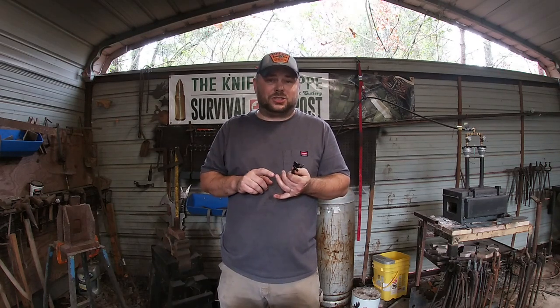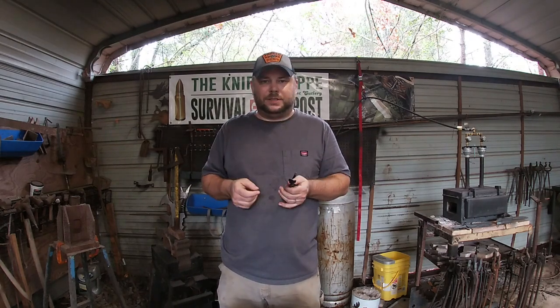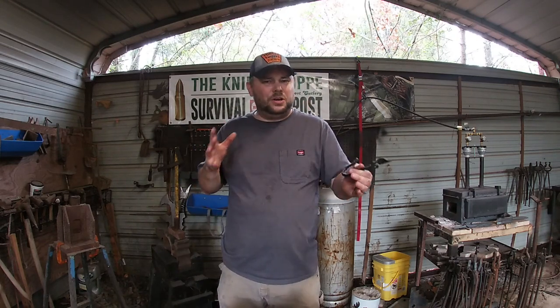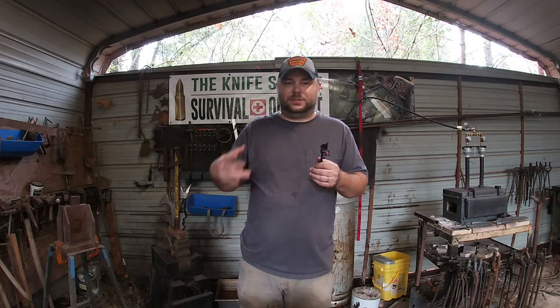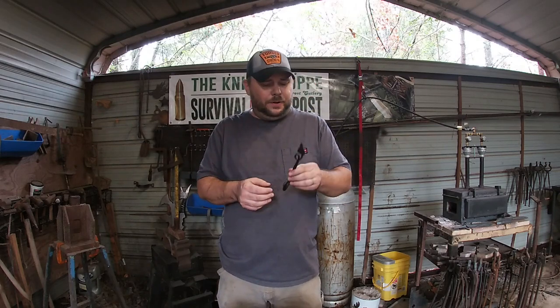These are really good scrap material projects. So if you have a piece that is 1/2 inch, but it's only like that long, like 6-8 inches long, and you really can't make a nice hook out of it, you can draw it out a little bit more, make a leaf on one end, and you'll make a lot bigger leaf out of 1/2 inch. They make very nice leaves. And then draw the rest of it out, make it look like a vine, put a few curves in it.